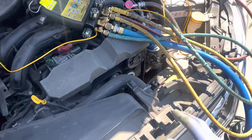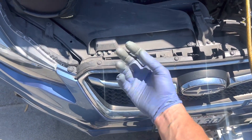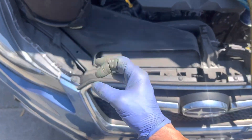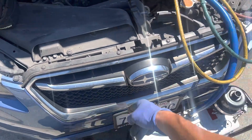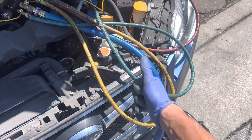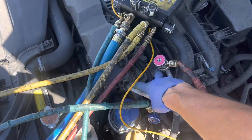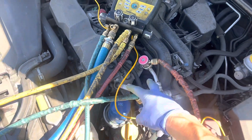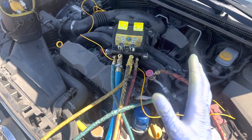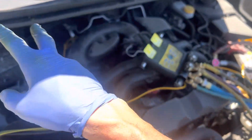I'm going to give them the bad news. If there's a plug down there, I've got to get back and look. Change the desiccant material — order a desiccant bag because it'll come with a new plug and O-ring, which should take care of that leak. Get a new O-ring at the fitting at the bottom of the condenser from the liquid line. Also change the O-rings that are notorious for leaking on Subarus. And I blew out the passenger cabin filter with air and cleaned it — it was good enough to go.